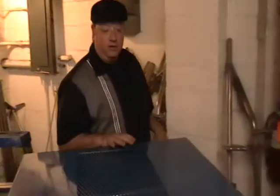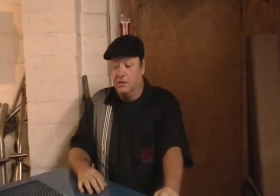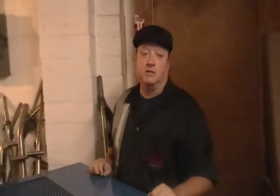I'll turn the vacuum on now and you'll notice that what we have in here is a positive displacement vacuum, and as everybody knows, like on carpet cleaning machines, they're very loud. But the silencing system on this allows us to run positive displacement blowers indoors. So what you'll basically hear is the CFM — the 600 CFM — as it enters the vacuum.